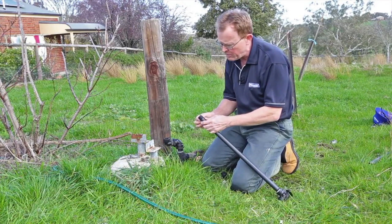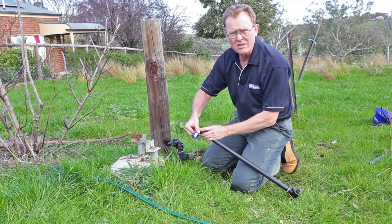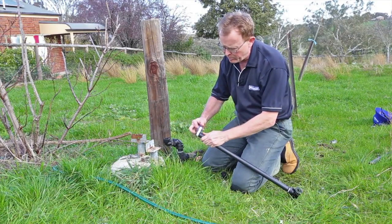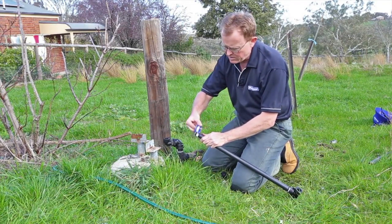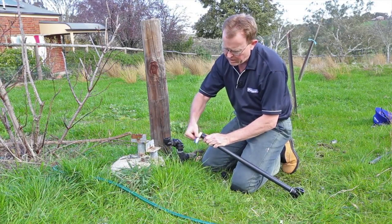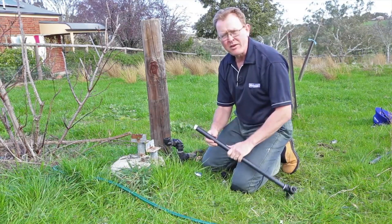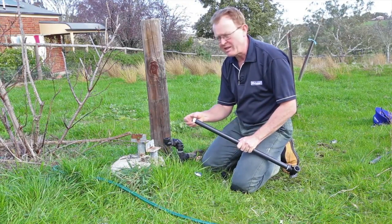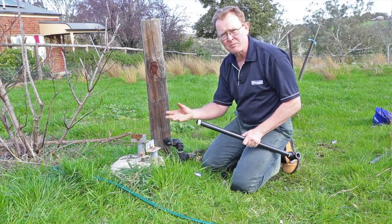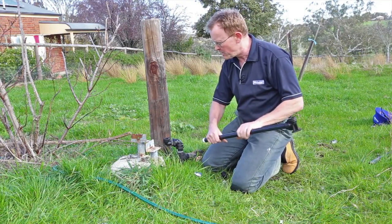We need to apply tension when we're applying the tape, and we need to make sure we go in a clockwise direction — I'm a right-hander. We do that to make sure when we tighten this thread up, we don't pull that thread tape off. Really, really important. You can see there, by holding it here I can apply plenty of tension to that tape. So there's two, three, four, five, six turns of that tape. It will vary depending on the fitting — sometimes plastic into metal, you may not need too much thread tape, probably five or six. If it's plastic to plastic, generally it can be a bit more. A great way of doing it is experience, or maybe even doing a dry fit and just seeing how that actually works.